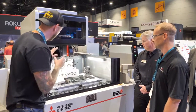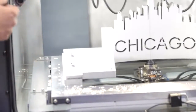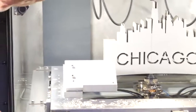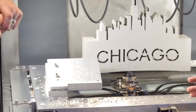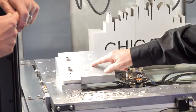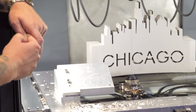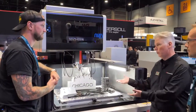What I'm seeing right here — I think I'm looking at this right — this is a four-axis toolpath, am I correct? It is not. It's just a simple two-axis but the block is elevated at about a 30-degree angle. What's the real challenge for people who may not be familiar with EDM? The challenge here is we're demonstrating the auto-threader — threading straight through the hole and actually going through the curve, threading at that angle through the curve, non-submerged.